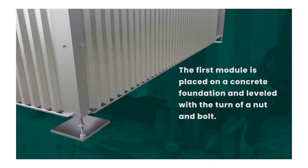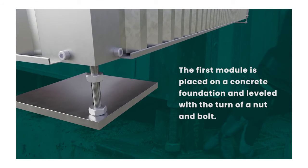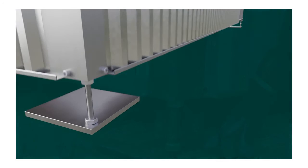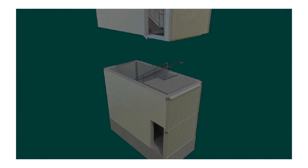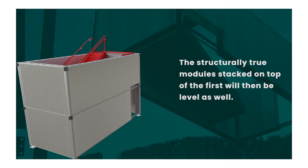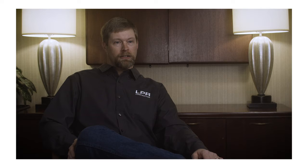I think it's easier to set the ReadyCore with the leveling bolts — you can adjust it a lot easier. The first one getting it set is the most important. As soon as you have that set and it's to grid, it's to elevation, then the rest is butter. It's cake. On you go upwards.